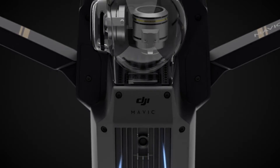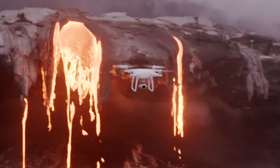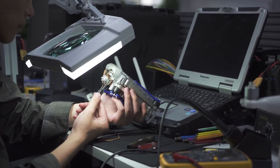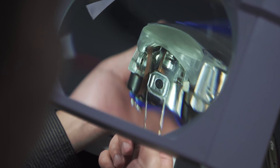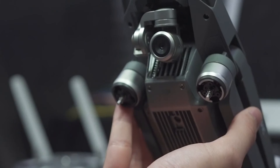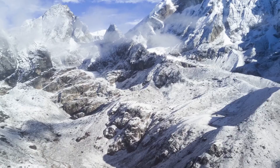We wouldn't go through all this trouble without making sure you have a great camera. We spent thousands of hours trying to re-engineer and shrink the stabilization technology found in our Phantom series. One of the major challenges we ran into when making a stabilized camera this small was the stiffness of the electrical wires. The mechanics, structure, and brushless motors had to be specifically engineered to account for this. Plus, it's the first DJI camera able to rotate 90 degrees for portrait shots.